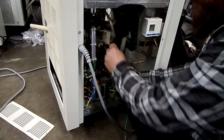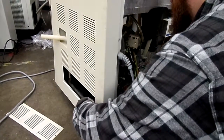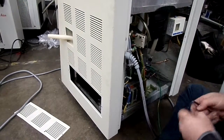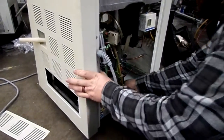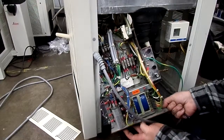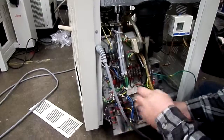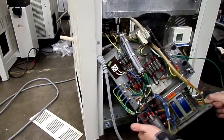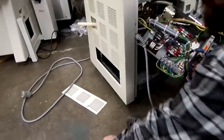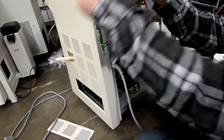Alright, this panel should — we may have to loosen this a little more. It's also got a little mount around the bottom that slides into a hole, so we'll just go ahead and take out the screw. Then your entire panel should slide out. You can see on the bottom here it's got the nut for the capacitor — that's what's holding it in the little hole there. Then grab yourself some safety wire and just get it out of the way so you've got a hole to work with.